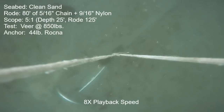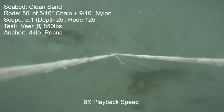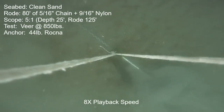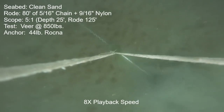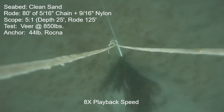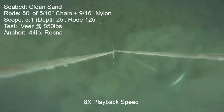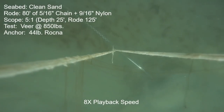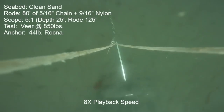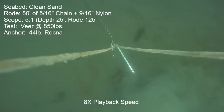On the second try the anchor sets just fine — nice clean seabed, not too many shells, not much seaweed. Similar story: it sort of holds the baseline with a lot of motion, just creeping along. At the 70-degree mark and again at the 90-degree mark it had full releases. The anchor was able to reset and complete the 180-degree veer. Then on the straight-line ramp-up the boat was moving two knots at 1,200 pounds of thrust, so I cut things off.